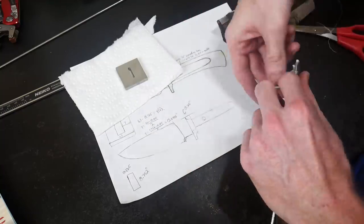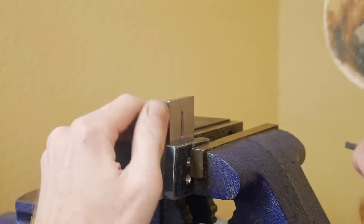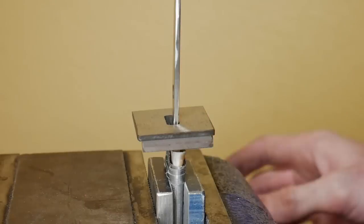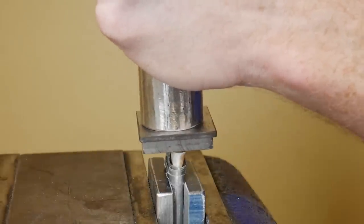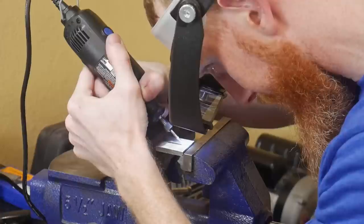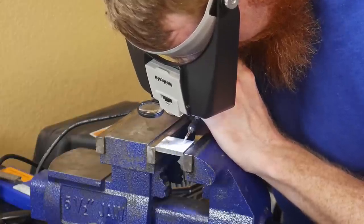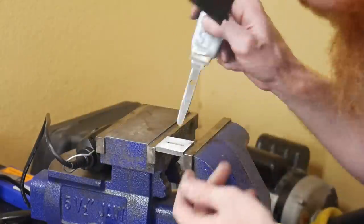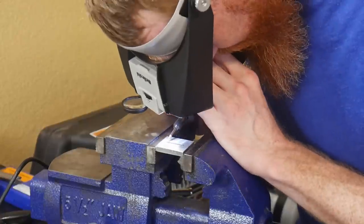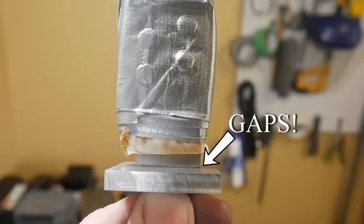To protect the blade during guard fitting, I wrapped it in some magazine paper coated with lubricant. I start off on the guard by squaring up the shoulders, since the mill leaves a radius there on the slot. Once I have the shoulders square, I place the guard onto the knife and tap on it a little bit with the hammer so I can get an indent showing where the ricasso is hitting on the guard. Then, using a Kyle Royer method, I took diamond-impregnated tips on my die grinder and started removing material where both of the shoulders are impacting the guard — this recesses the ricasso into the guard just a little bit, maybe ten thousandths, and removes gaps.